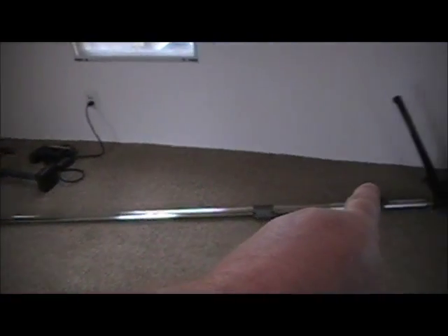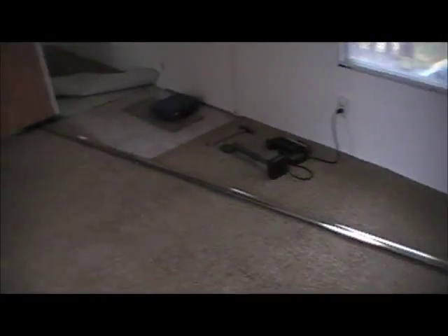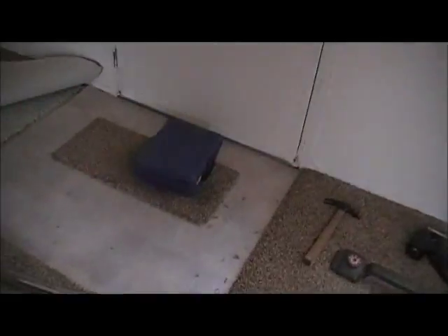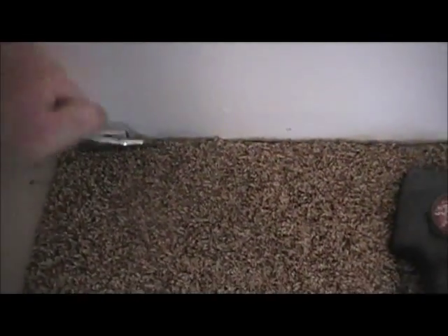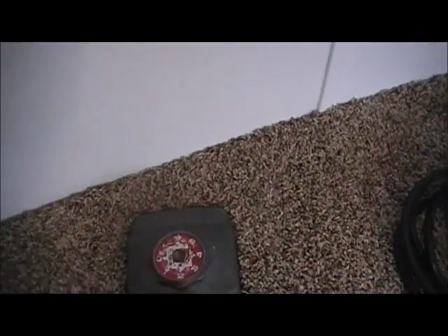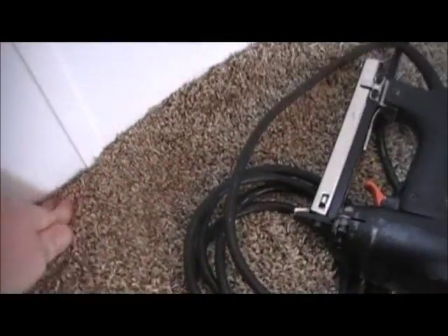Now I've got to go ahead and install that wall. Get that all tucked in there. And then we can go and stretch this way. Basically how you tuck in a wall — you've got to take your handy kicker again. Bump that stuff up. Take this tool and you push it down on that little channel I was talking about earlier. Remember the little quarter-inch channel there? Just tuck it in. And I always just go back and push down with my hand and make sure they're on the nails real good.